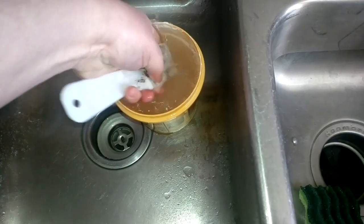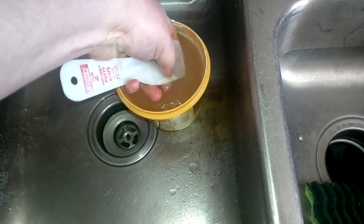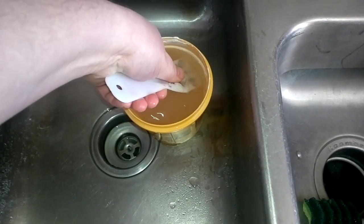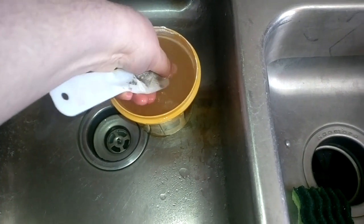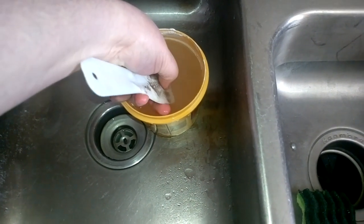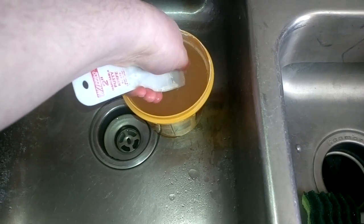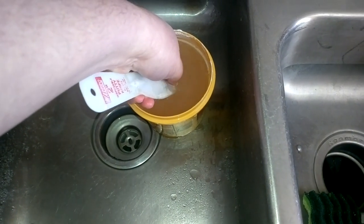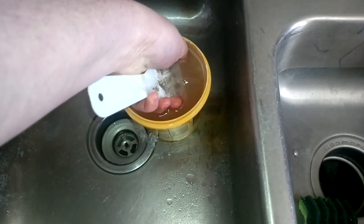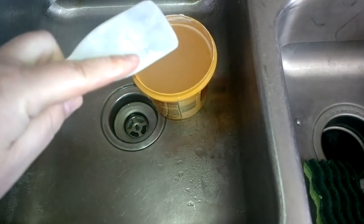Definitely want the flexibility of a plastic spatula — putty knife. This one's two inch. Two inch is pretty good, depends on the size of the hole you're working with. You can also use one inch if it's just small nail holes. Usually if you're patching up your drywall to paint, maybe like a sixteenth of an inch might be okay to paint over, but anything over that you probably want to put some putty — otherwise you'll risk your paint not covering the hole. And that's clean-ish.